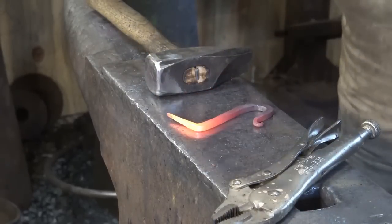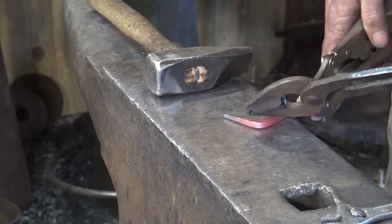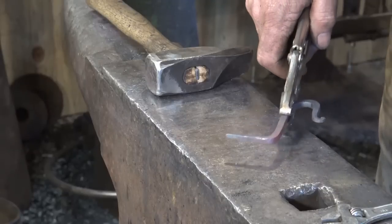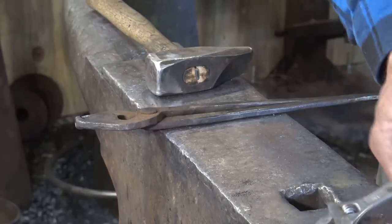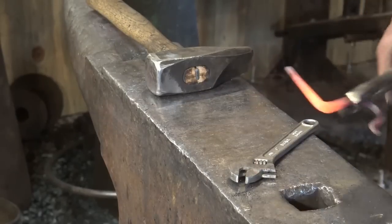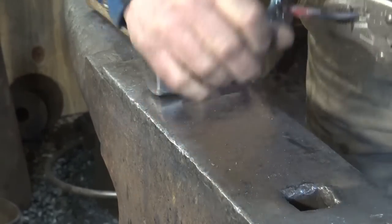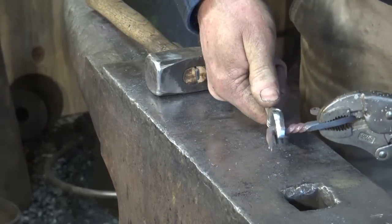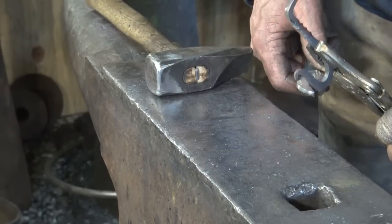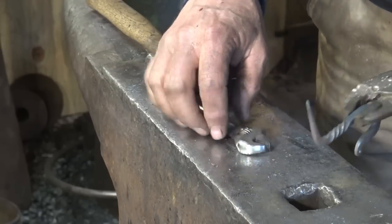Now I've been holding this in a pair of tongs and keep talking about not having tools. You have to have a way to hold it, but you can get by with holding it in a pair of vise grips — I'm going to clamp this pair of vise grips right up in there when we come back to this. I'm going to heat it up again and that will hold that part. I'm going to put a little crescent wrench on here and then I'll be able to twist that just freehand. One problem with vise grips is they will often leave marks — if you're going to use them as tongs you might want to grind the teeth off of them. Make sure it's all straight at this point, and if it's not you can put the crescent wrench back on and twist a little more or less, whatever you need to do.